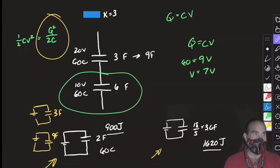So that's why. Effectively, what we have to look at is how much charge are you having to bring out of the battery to deal with what you're doing to the system. When we had the other capacitor there, it's like we had a well of charges that we could use because the total capacitance was not affected as much by the insertion of the dielectric, because the other capacitor padded it. Does that make sense? Sense at home? Moving on.